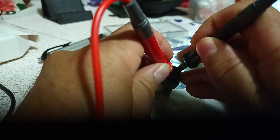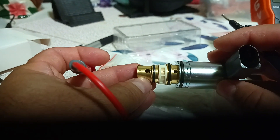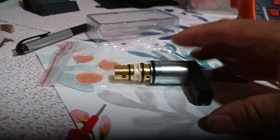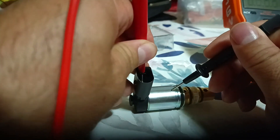There we go, that's nine ohms. So we got nine ohms on both of those, which means that looks right. I apologize for the movement — I have this hanging from my neck on a flexible mount. That looks to be what the new one has. I did check for grounding to see if the pins are grounded, and they are not. Just something to check.